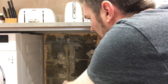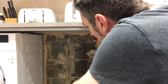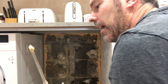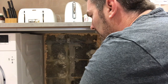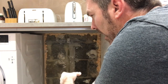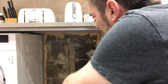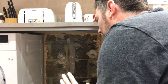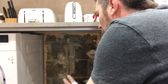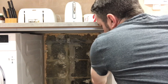We'll vent it straight out of the side there. I'm going to PVA that wall before I put the dryer in. I've foamed it all the way around the gap so we don't want any air gaps. This is a foam adhesive — this is what it's used for, the sole purpose of foam. Once that dries — about 30 minutes — we'll just cut it off neatly, then it's sealed. PVA seal it, then the freestanding dryer can push back. We'll mark the vent and get it straight through the wall. Plenty of ventilation with some holes in here, all the way down, all the way across.